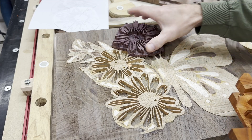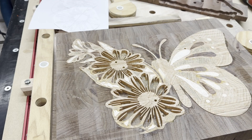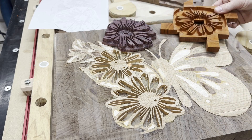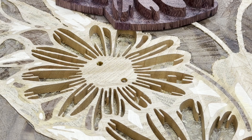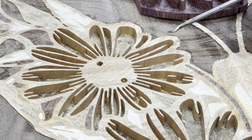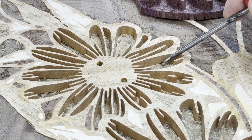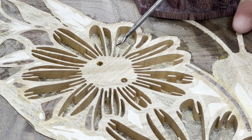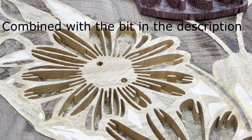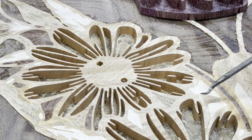This is one I'm just finishing up for the first time — it started with a clip art file from a package I had downloaded, and I did a lot of work to clean it up and make it work better. Using the settings I detailed in my previous video, I've got pretty much perfect glue gaps — just a tiny little glue line here. I ended up at 120 thousandths on the glue gap and 200 on the surface gap, and even with a massive inlay like this, I've got pretty much perfect glue lines.